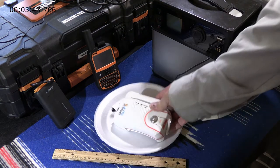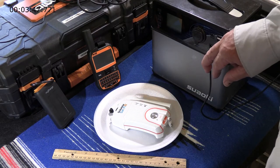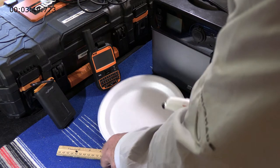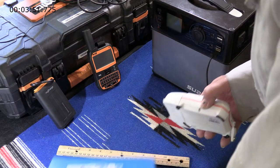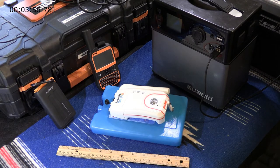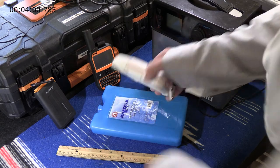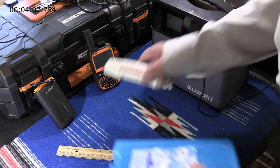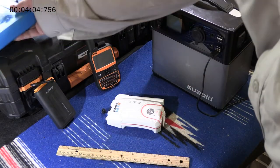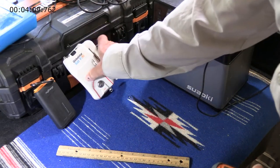The unit gets hot. If you have it on top of a car, I would put something insulating like a paper plate underneath it. If you're out in the desert like me and have some blue ice available, you might try putting that on the bottom — it's sealed at the bottom and there's no condensation with a pack of blue ice. Heat kills batteries, so anything you can do to keep the unit cool is a good idea.